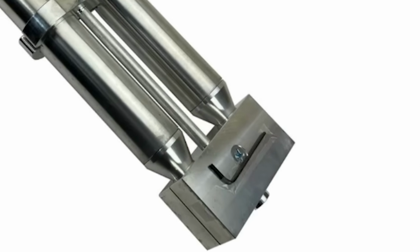And since we're doing injection, we need a dual injector, but not the Do It one this time. We are gonna up the ante and go to N2. A couple huge differences though between an N2 setup or even a bass tackle setup and the Do It dual that I showed you earlier, the biggest of which is safety. What I mean by that is there's no locking pins on the end of the nozzles on the Do It dual. I don't know why they don't change that design, but it is basically just pushed in there with an O-ring, which means if you're not careful and as you're injecting you push too hard or too long, you can actually push that nozzle out the end of the tube, and piping hot 330 or whatever degree Plastisol goes everywhere.